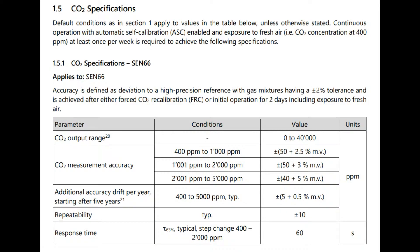The CO2 sensor, having been used to the SCD40, is good for basically 400 to 5,000 PPM typical accuracy. It can go a little bit higher, but it's basically meant for indoor sensing. Outdoor CO2 is about 400 PPM and crawling up a little bit. You do have to expose the sensor to outdoor air once a week for it to self-calibrate, otherwise it can drift a little bit. If you're looking to measure something that's high CO2 and not expecting to take it outside, you might have to do some manual calibration.